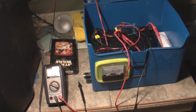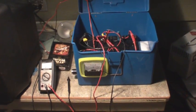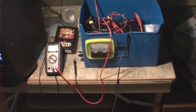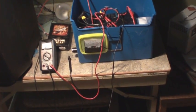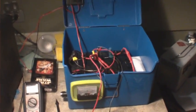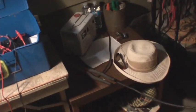When you go through revival you'll find they'll come up to about 13.2. They'll never hold the original 13.5, but 13.2 to 13.3. Now the other interesting thing is if you put them on MPPT solar charge control - which I'm not doing here - but in that larger bank I've seen that it also desulfates batteries. I'm quite convinced of it. What it does is sit there and pulse the bank with whaps of current, the frequency is always changing, setting up a sort of harmonic rhythm that at times matches whatever it takes to desulfate batteries. It acts like a PWM pulsing large portions of current into the system, especially when you've got over 300 watts of solar panels.